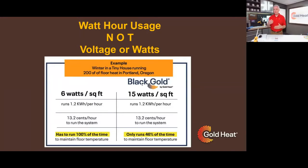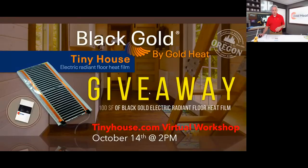So it'll run on a full on, full off cycle, but it'll only be powered on for 46% of the time. That is going to give you the same amount of heat. It's going to draw the same amount of power, but what it's going to give you in addition to the 6-watt system is the headroom to run more if it needs to in a more demanding situation. So in a one-on-one example like this, you're not going to see a difference in your power consumption, but where you need more heat, in South Dakota in winter or in a house that doesn't have quite as much insulation, then you have the ability to run the system more to compensate for that. So that's another myth that I've run into out there several times.